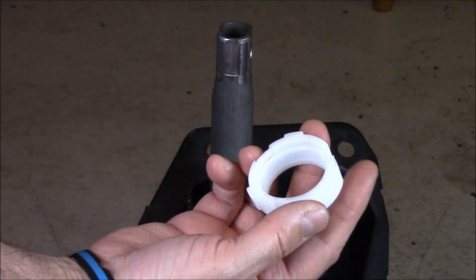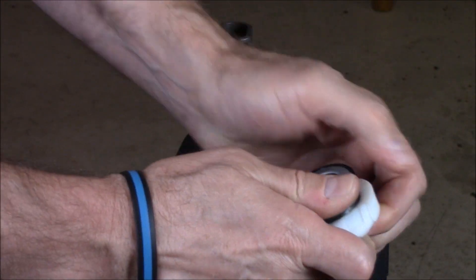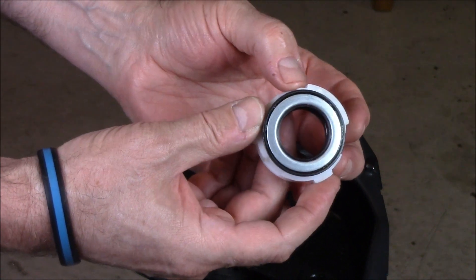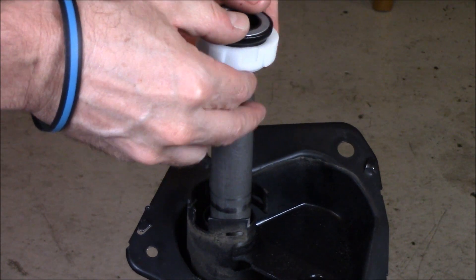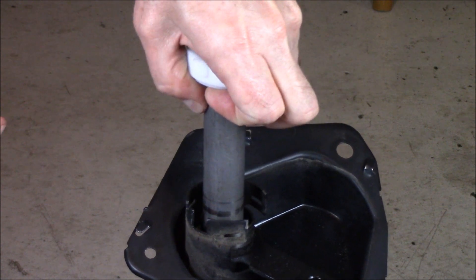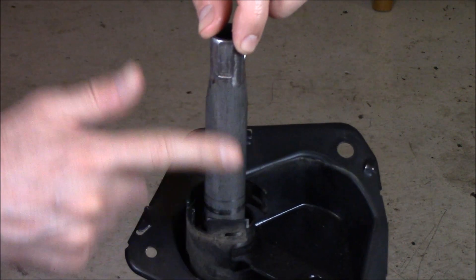With my bearing ready to go, let's take a look at this. This is the carrier that it goes in — the bearing just snaps in with a bit of pressure, snaps right into the carrier. Now this thing is also keyed — there's a fat key and little keys. So when it goes in, the fat part is going to be right here at this opening — just keep that in mind when you put it together. Then once you get it to this point, I'm going to take a little bit of oil and just coat this real quick so that bearing doesn't catch on anything going down and doesn't roll the O-ring.